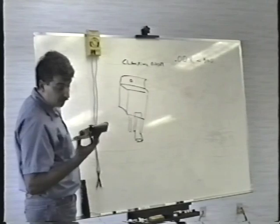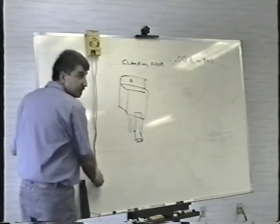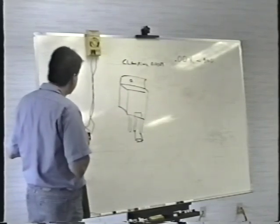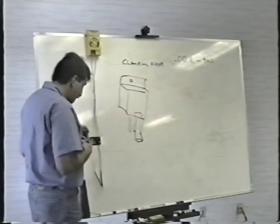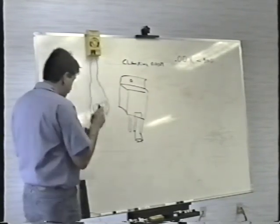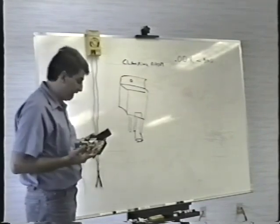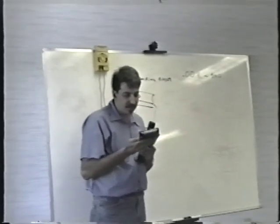Why the fuse is blown, I don't know. Probably in this case, we'll be able to put the new fuse in and have it work. There's a couple of other diodes here. I'm going to quickly check. Let me just see something here. Yeah, that's good, as I expected. This one, I really have no idea why the fuse is blown. It does appear to be blown, and I should probably double-check it with my meter. Yeah, it's definitely blown. And yet, I don't really see anything in particular that might cause that to blow. So at this point, I might consider changing it.